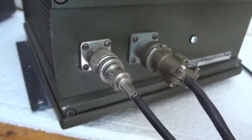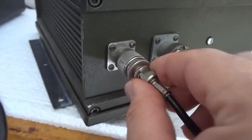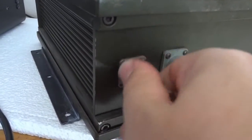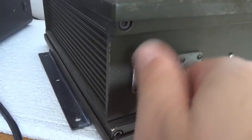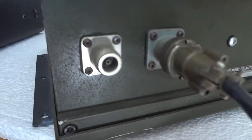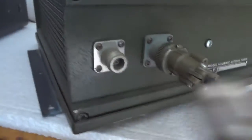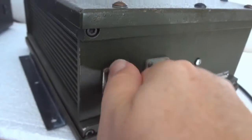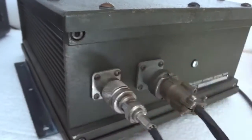This is how you interface with it. There is a 50 ohm input - it uses an N connector, not a cheap SO239. I have an N to BNC adapter here. You might need a professional plug for that.